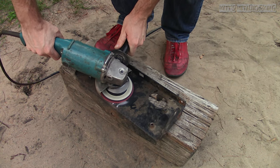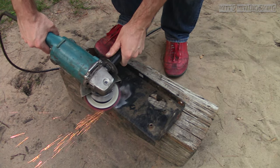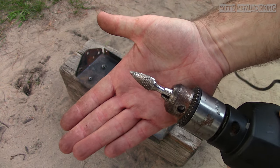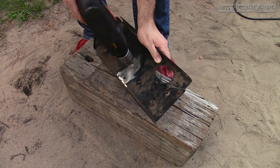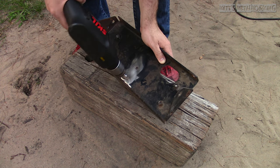If you are working with a vehicle body panel, be extremely careful with the grinder as this too can create excessive heat causing warpage in a panel. To clean out the inside of the hole, a rat tail file, burr bit, stone, or even a drill up to the next size will be fine. Make sure you also have a clean spot for that ground clamp.